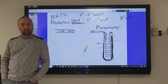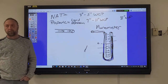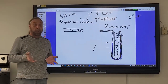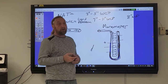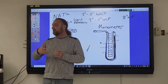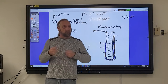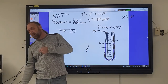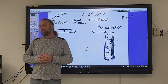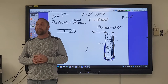Eight inches WCP indicates propane or LP gas. We also have a digital manometer — just like a digital meter — where you attach a hose and it reads digitally, which is easier than the water tube type since water can spill out and you won't have water in it next time.